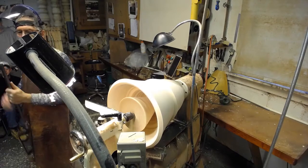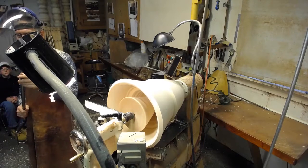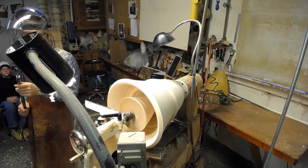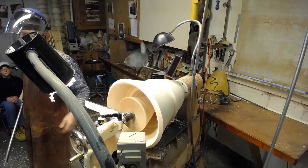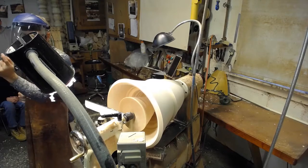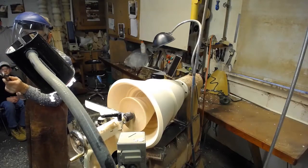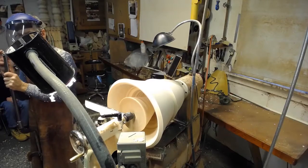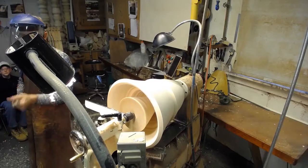Oh, yeah, you could grind away the tip of a... but those are carbide, they'd be hard to manipulate, wouldn't they? Yeah. Well, that's interesting, I've never used those tools. But the pointier that little end is, the easier it'll slide into the wood. And then you can use the shoulders on either side of the tip to widen, like the McNaughton does.